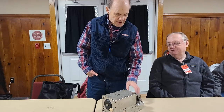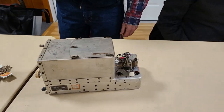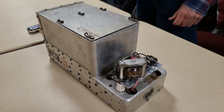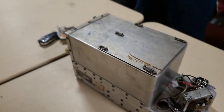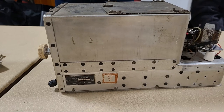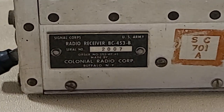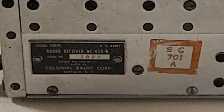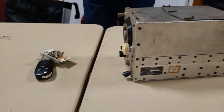So I replaced that and put a little adapter plate on the back for the audio transformer and a terminal strip for power. These normally ran off aircraft power, which on military aircraft was 28 volt DC. The heaters were wired as two 12-volt tubes in series, and a dynamotor sat on the back. A dynamotor is a motor-generator set — 28 volts drives the motor, and the generator outputs the B-plus at somewhere around 175 to 200 volts.